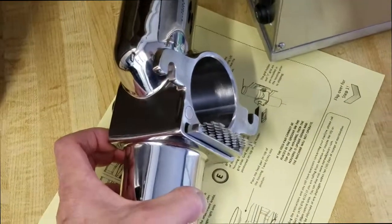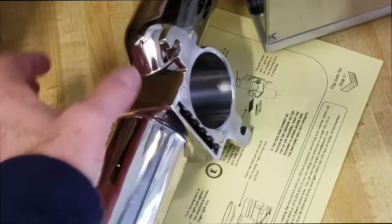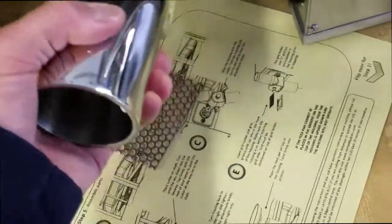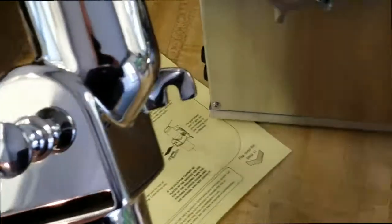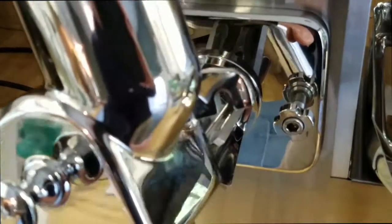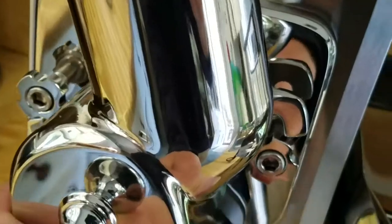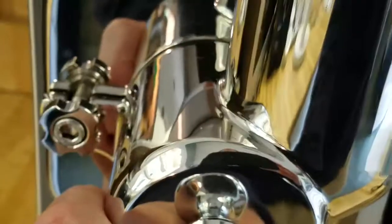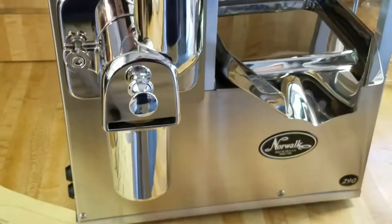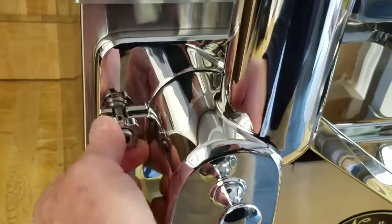Next is the housing — it looks like a gigantic tube. You'll see the screen inside, which was put in there when you got it — let that slide out. Grab the housing and put it over the cutter. You'll see little places for screws; turn the housing to the left slightly so both sides of the groove engage those screws. Line up the hole with the cutter and turn it so it pushes flush with the unit and latches in. Once the housing is on, finger-tighten the screws — don't over-tighten, just keep it secure without the housing moving back and forth.